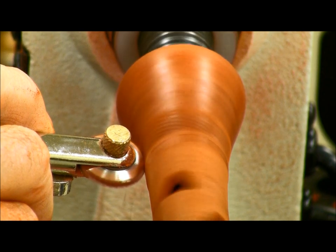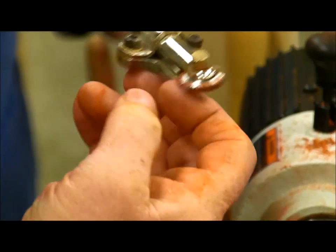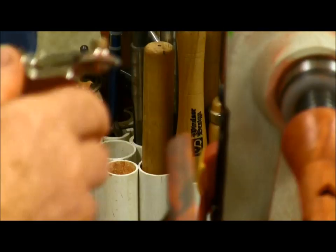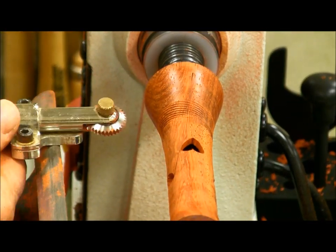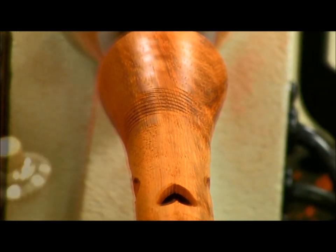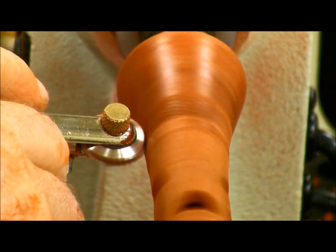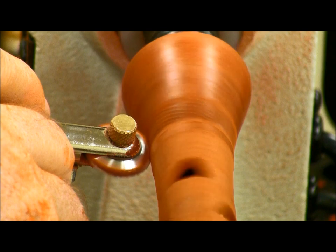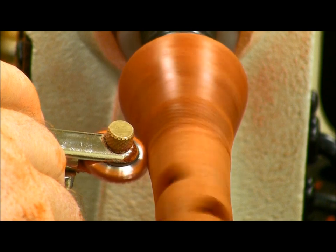You can't do it too fast. So you're below center? Just slightly — the top edge of this is what does the cutting. I've got a nice pattern right there now. With it turned this way I've got a pattern in one direction. Rather than go deeper, I'm going to go right at center and gently go in there — it'll find that groove I was already in — dip it down just a little bit and it'll start cutting. You don't want to advance it too fast.